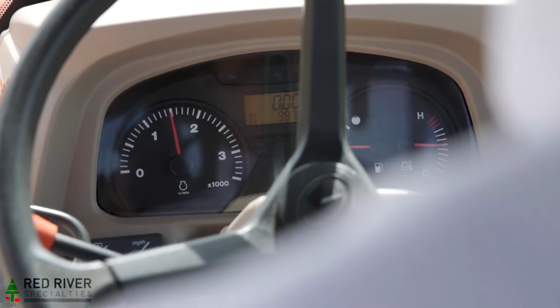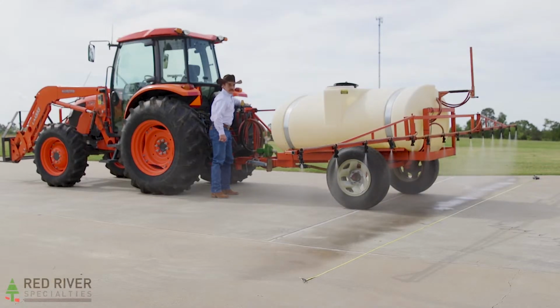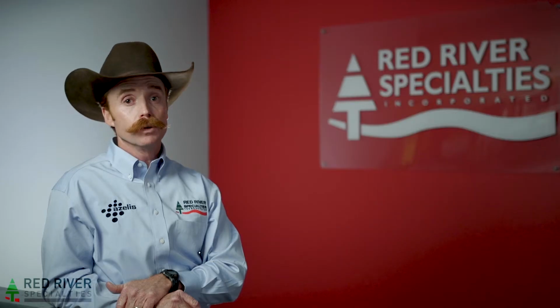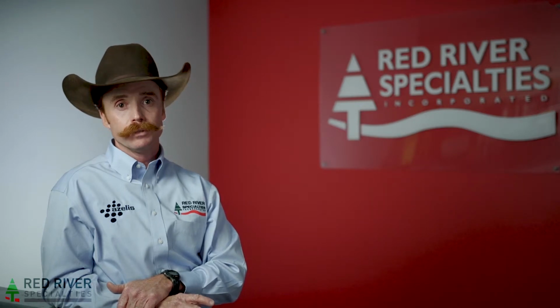Second, make sure the tractor is at the RPM that you'll be spraying at. If it's only idling, you won't get the proper pressure on the sprayer and you will not get the correct gallons per minute. If you have more than one nozzle, do this for each one. It is also a good idea to do this a few times on each nozzle and take the averages.